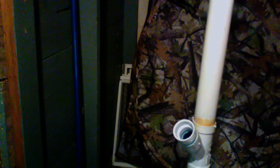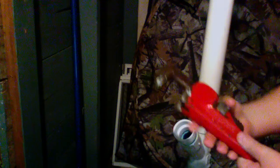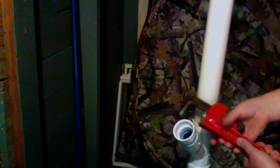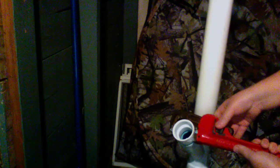Just so you know, you do not need the nubs and fittings anymore to put a twist lock cover in. The modern twist lock cover has screws, so that's why. Now we're just going to get our wrench on it. Remember: do the three-corner bite — I'll remind you in every video where you use wrenches. See where I have all three corners touching? That means I can get maximum tightening without having to worry about deforming or cracking anything.